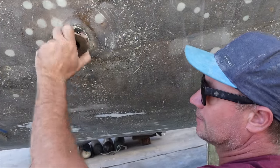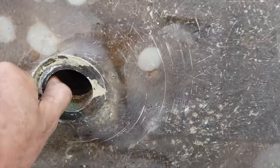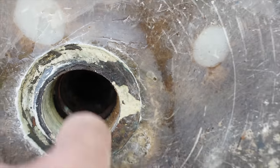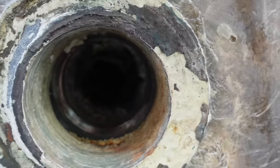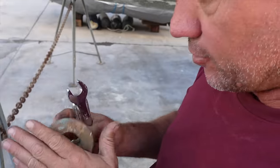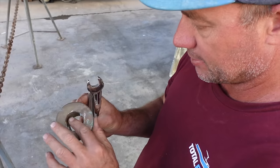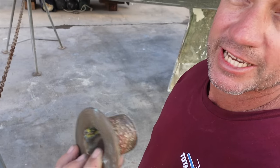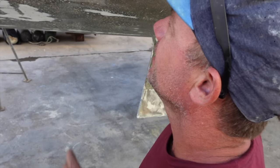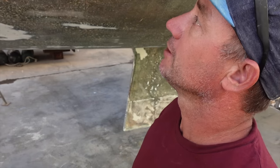Does it look okay? Can we just reuse it? I'll clean all this up. It looks like it's been epoxied in the past and done properly. There was a lot of corrosion — I've sanded it right down to get through all the pitting. The color's not the best and it is pretty thin, so we'll be replacing these. We're going to pull out the valve and backing plate next, reassemble it on the bench, and go through replacing all of these if we can get them out.